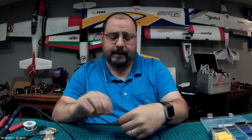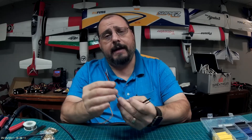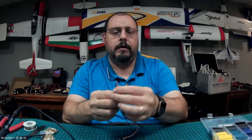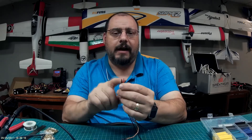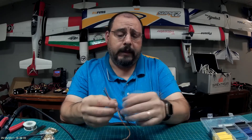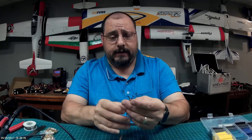I hope that was insightful and helpful. Next time you can do one on your own. I've got two more to go and a battery adapter to throw on this end. Although since this is going to go in a drone, you pretty much have to solder this directly into a power distribution board — so that's where the bullet connectors aren't going to come in handy, but in this situation they're great.